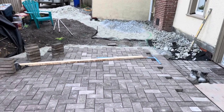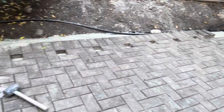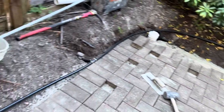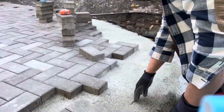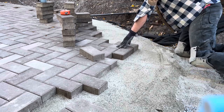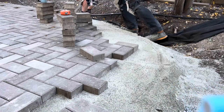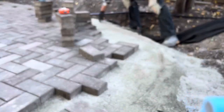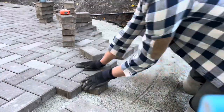Still working in the shade here. It took about three hours to get all this laid in. And you can see that most of it is just sort of half paver cuts. Then we can start to work on this nice curved area as well. For curvatures, you can set up a really nice radius — you can even use a piece of conduit or something like that. It's going to keep a nice curvature for you.